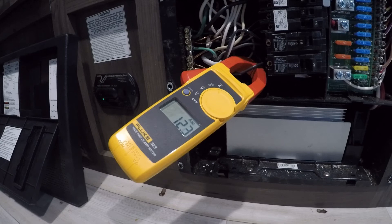A soft start capacitor would probably be a better bang for your buck, but if you get one of these hard starts it'll definitely do the job. Do your research — there are many AC techs out there. I have a little bit of an HVAC background from working alongside techs where I used to work. When the compressor starts to get bad, they throw these things on to make them fire off a little easier when the compressor's on its last leg.